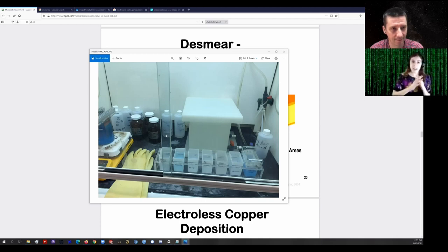Remember, we have this fiberglass, which is composed of the glass component and the epoxy. The epoxy is an organic molecule — it's a polymer — and there are all these chemical functionalities that in the presence of certain chemicals can be rendered charged. So in the first bath, we have what's called a micro-etch. This is usually a mild oxidizer like a persulfate, such as sodium persulfate, which can actually be used to etch copper. But this is a much more dilute solution, so it won't etch the copper. It will chemically modify the surface inside the holes to generate a very mild charge on the inside of the hole, which will then electrostatically attract tin ions in the next step.